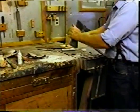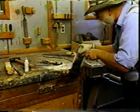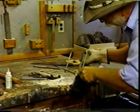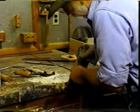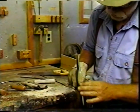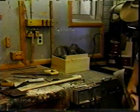Now all we have to do is trim the wedge off, so back to the vise. Cover our edge up again, get our glove on and our coping saw. Notice how much softer this poplar is than the hickory was to cut off — it just flies right through it. Easy on the end here so you don't split it. There it is — properly fixed, properly hung. Never put the steel wedges in cross-grain, which you sometimes see in axes. Why would you want to split the grain, which this does, after you've just hung an axe?